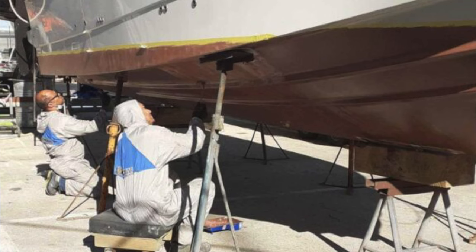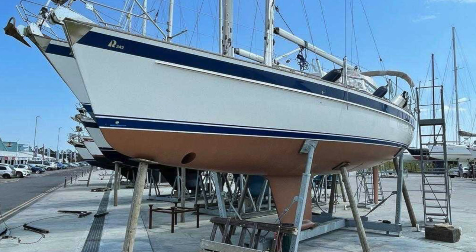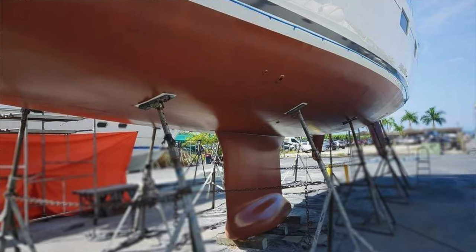What about preparing the hull ready to put this on? Can I just stick it over the top of my existing anti-fouling? No, and that is another key difference. With Coppercoat being an epoxy, it needs to go onto a firm, stable substrate. You couldn't put it on top of last year's ablative anti-foul because that will eventually come off and it would bring the Coppercoat with it. So you strip the boat of any existing anti-foul and apply this direct to the gel coat. The obvious thing to do if you're buying a new boat is just go straight for the Coppercoat — best time — and lots of boat manufacturers will offer you Coppercoat as an optional extra when specifying the boat.